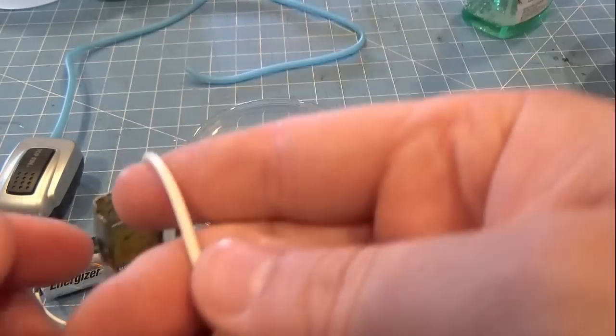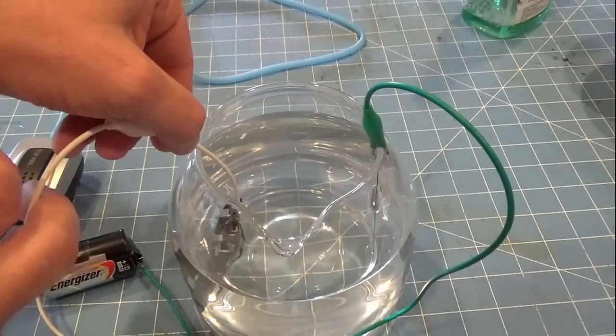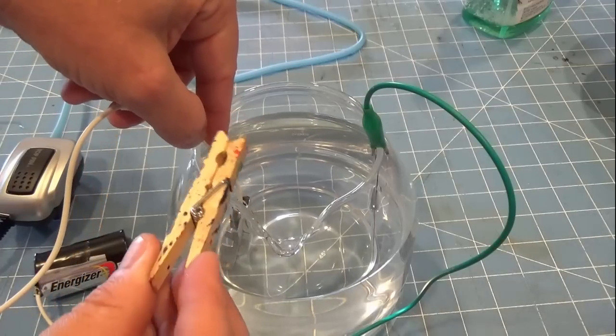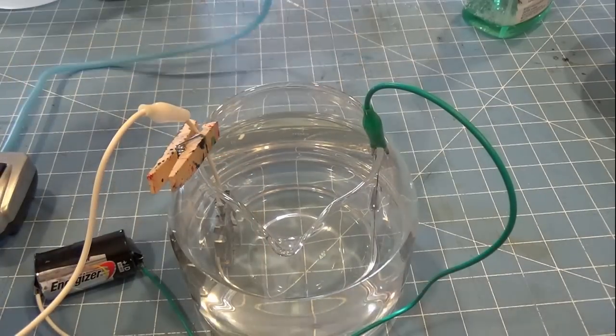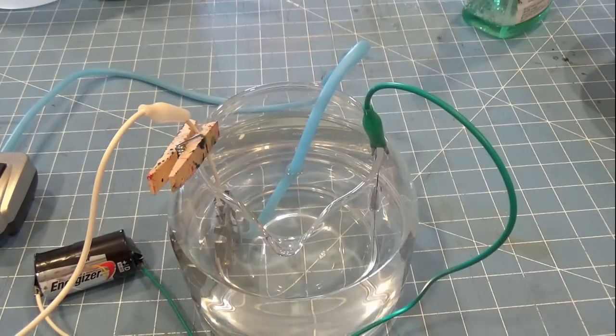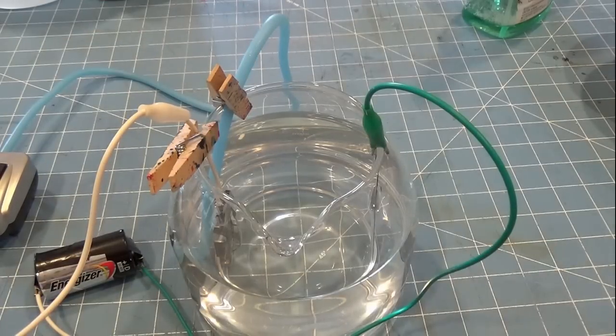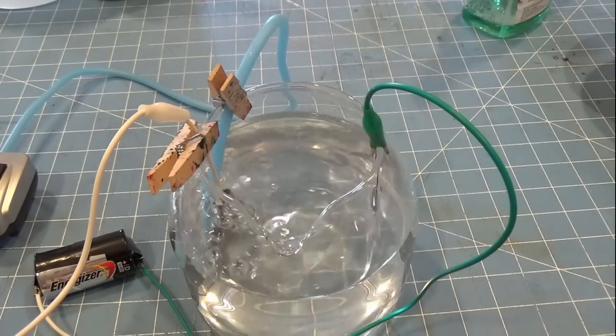With everything ready, I can now begin plating the car. The setup is simple. I have a zinc electrode connected to the positive side of my D-cell battery, and the car is connected to the negative side. I'll suspend the car in the solution using a clamp, making sure the car is fully submerged and at the maximum distance from the zinc electrode. When everything is in place, I'll add my aquarium pump tube to introduce bubbles. These bubbles will agitate the bath and cause any bubbles forming on the car to dislodge. If you do not agitate the bath, the bubbles can remain on the metal surface and cause circles, giving an inconsistent plate. Because I'm using a single zinc electrode, I'll need to turn the car about every 15 minutes to be sure that the sides are also well plated.